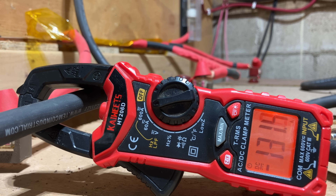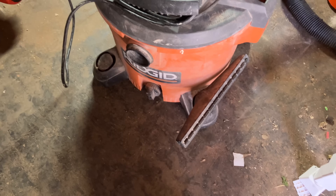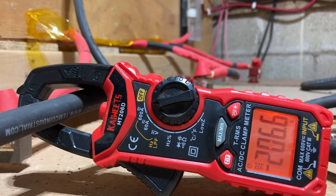Here's another test that gives you a good example. We're at about 140 amps, then I hit it with the chop saw — you can hear it in the background. We're sitting at about 140 amps and then you see it pop up to almost 300 amps. That's the chop saw. I ran it over and over again, running over 200 amps with very heavy loads.